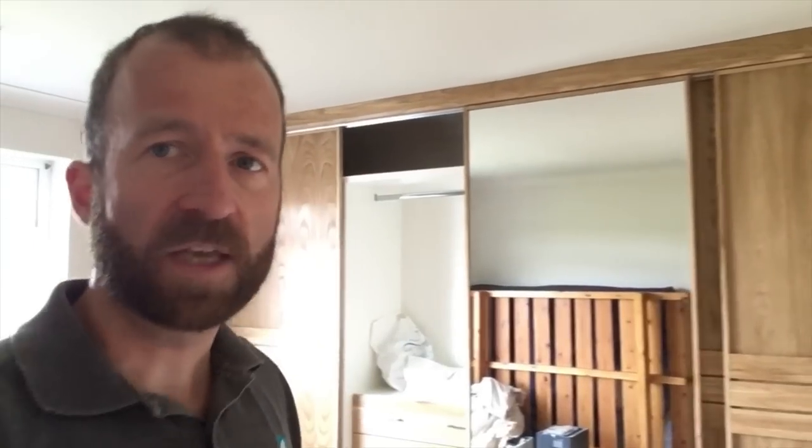These are bottom-running, but it can also happen if they're top-running. Generally the sliding door hardware is fitted to the back, so the centre of gravity of the board is offset from the hardware. Whether top or bottom mounted, it's not a great surprise this has happened. These doors were only 16 millimetres thick.